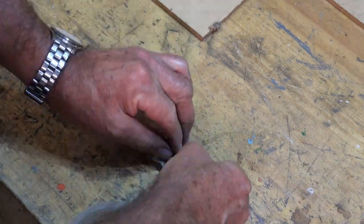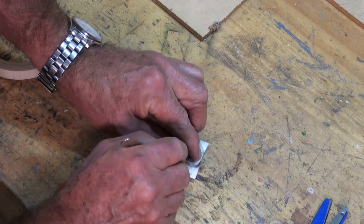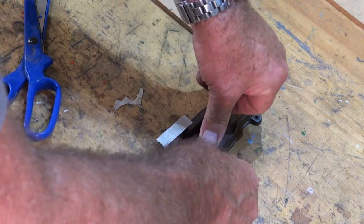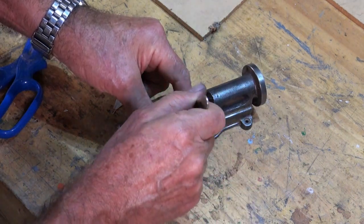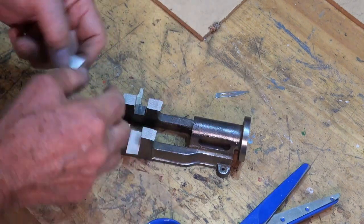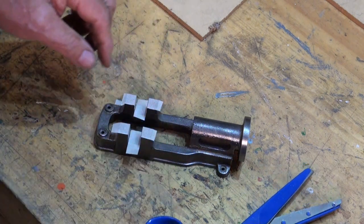This is the lower cylinder cover, and this face that I'm covering up here now will have a gasket fitted to it later, so it's definitely an area I didn't want powder coat to go. The finished powder coat is actually much thicker than ordinary paint, and for that reason I didn't want any powder coat to go in this area where the bearing brasses will fit. They're essentially a sliding fit, and even the tiniest trace of powder coat would stop them going in. So once again, it's just a lot of tedious taping that needs to be done. It certainly saves time later though.